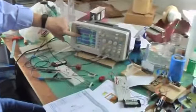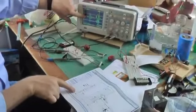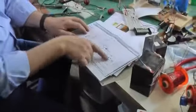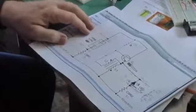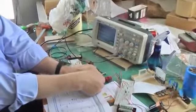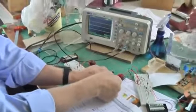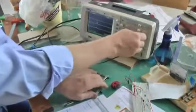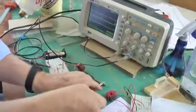The idea I've been working on is looking at the input power — the green waveform — and making that smaller. I can do that by adjusting the various resistances, capacitors, and so on in the circuit. I've got one more variable resistor right here. As I vary that, you can watch the green trace — the power. You can see it goes way down. The light is still lit, but the input power goes from quite a large value down to just very little. It gets very small.